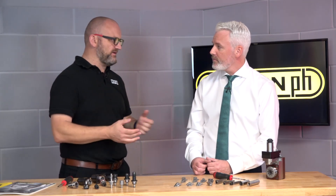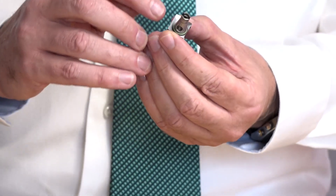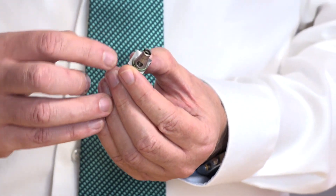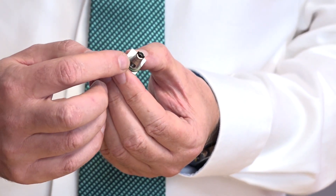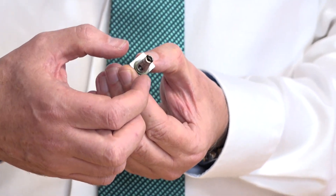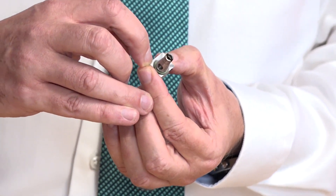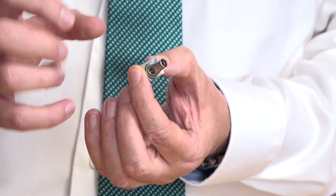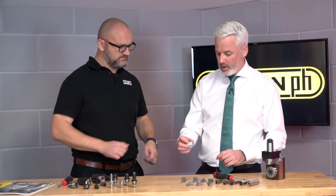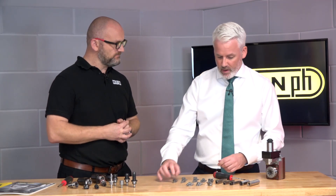You essentially mate two pieces of metal together so there is a rigidity concern, but with a three-point location that argument may be unfounded. There's a lot of thought going into the design of this interface - it's made up of three elements. The most obvious is the taper, which centralizes the tool and provides positional accuracy. For stability on side loads, there's contact on the face and on a cylinder. For turning tools there's also a groove at the back which mates with a bar inside the bore, providing rotational stability and accuracy. They're all through coolant ready.